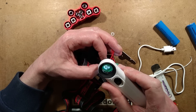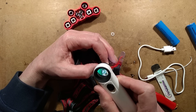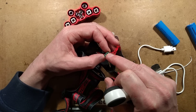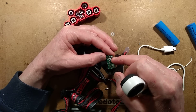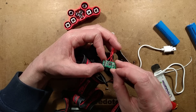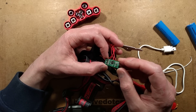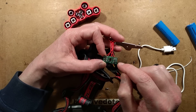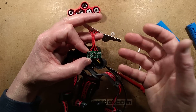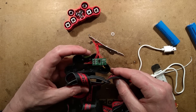The resistors are marked 512 — 5.1K. The reason for the resistors: they're not in line with the gates of the MOSFETs, they're across — pulling down — basically making sure it turns off completely when this is in sleep mode. And there's a localised power supply decoupling — a little resistor and capacitor just to power the chip. I'll take a picture of this circuit board.